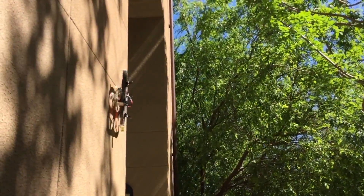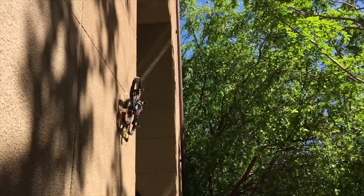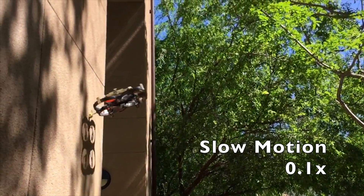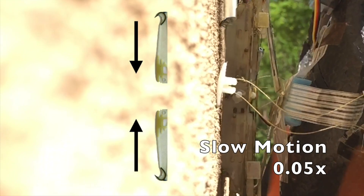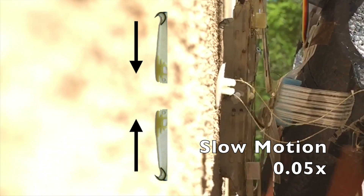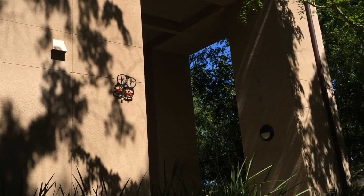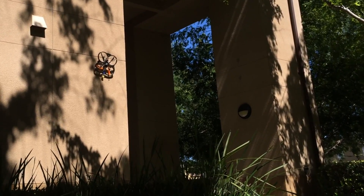For vertical surface perching, upon a gentle impact, the quadcopter pivots on its tail spines to align with the surface. The thrust pushes the quadcopter into the surface to trigger the truss-collapsing landing gear. The two groups of opposed micro-spines are pulled inward to provide grasping force to counterbalance with the pitch-back moment.